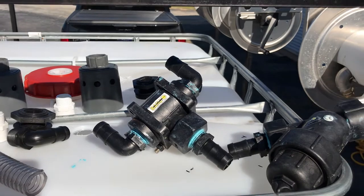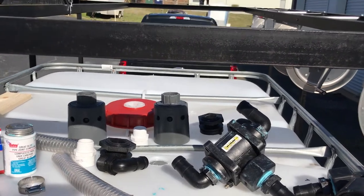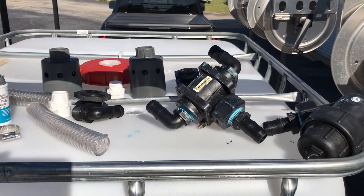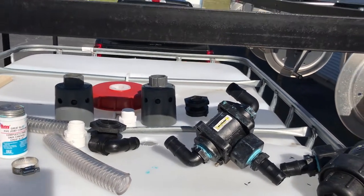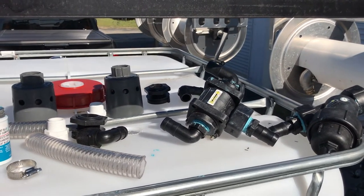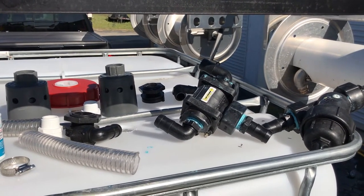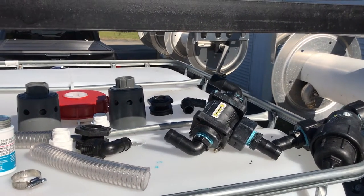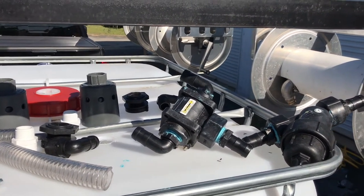The reason we're doing this is because we are going to put two inputs into the tank. One of the Hudson valves will be lowered in the tank so that we'll have about a 75-gallon buffer tank. The other Hudson valve will be at the top so we can fill the tank all the way to the 330-gallon mark. When you're getting towards the end of a job you don't need 330 gallons, or you're doing a small job, or maybe you're only doing a house wash — running a little bit of water versus running your eight-gallon-a-minute machine with your seven-gallon rinse. That means we don't have to dump or transport 300 gallons at the end of a job.